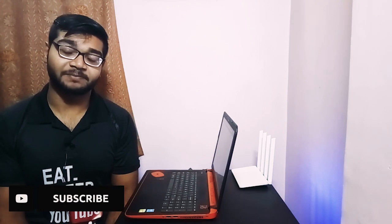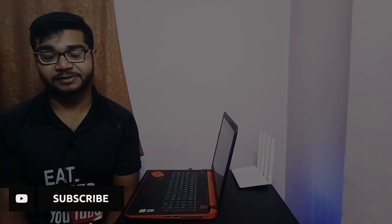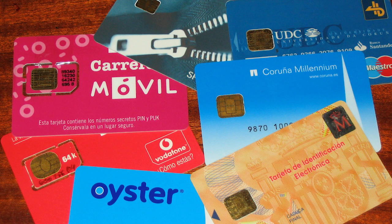So this means the older magnetic strip based cards were very insecure, and it was very easy to clone these cards onto a blank card, and also future transactions didn't even require the card holder to be present physically to enter the PIN. So now the older magnetic strip based cards are being replaced with these modern EMV chip based cards. Well, these cards have a microchip which looks quite similar to the SIM card present in your mobile device. All the user information of the card holder as well as the issuing bank account details is stored inside this microchip.